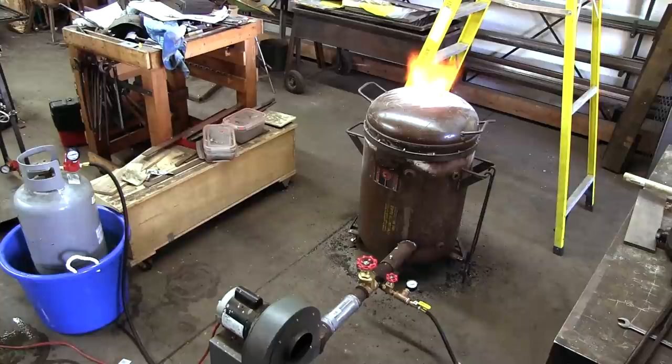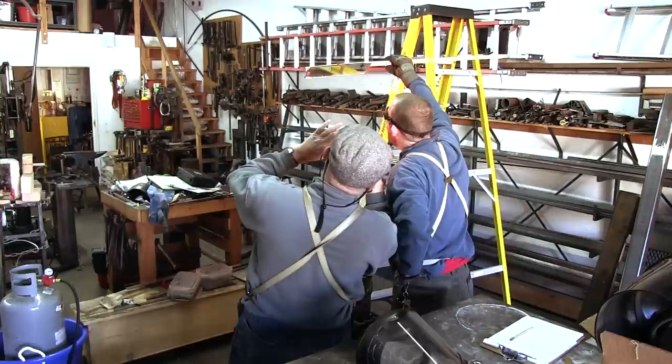It takes a while for the furnace to come up to temperature since all the concrete needs to be heated up too. The first ingredient that is going to melt is the glass, which ends up coating the wrought iron. We use a mirror and welding goggles to look inside to see what is going on. This is not easy to capture with the video camera.